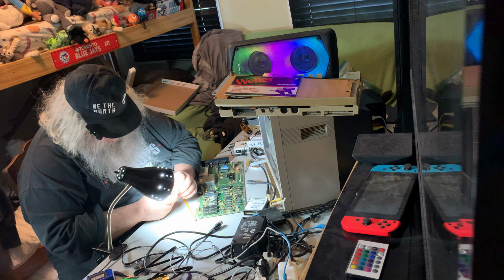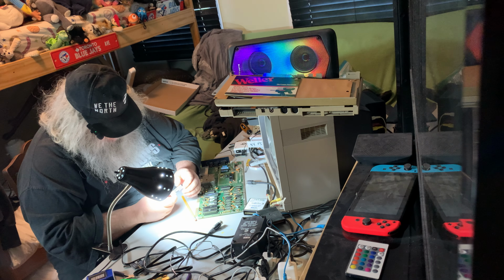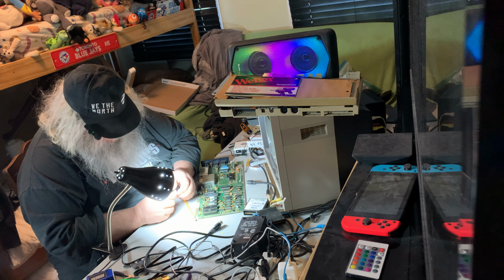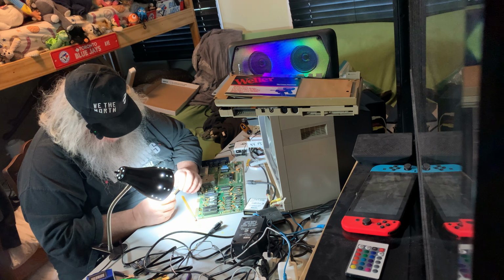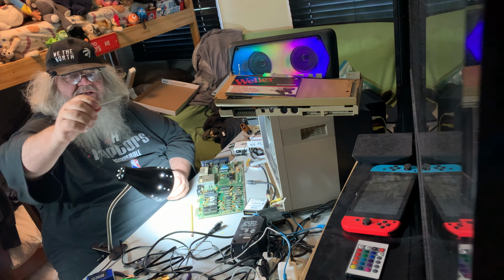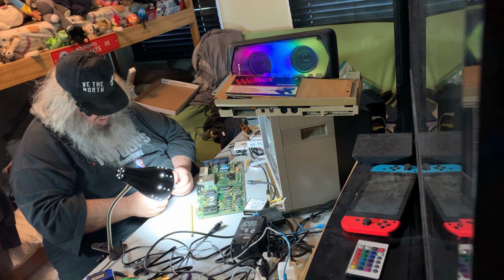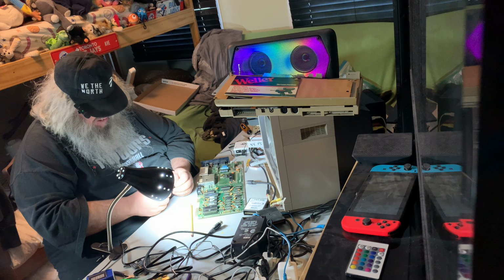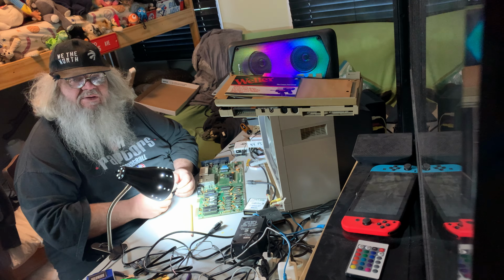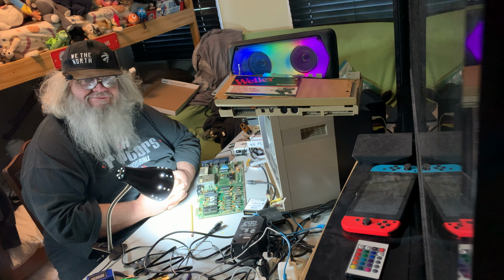And as I look at this, earlier on, when I was working on a PET, I had the misfortune of breaking a chip. Sorry, not a chip, a pin on a chip. And it may be that these pins on here may be candidates to pick up. See, the pins have, and I know you can't see this very well, a big section at the top, a little section at the bottom. They usually break off where they're smaller. But it may be, if this chip is still dead, that I will do what I can to rescue an entire pin and then see if I can solder that onto the chip that has the broken pin. I might.